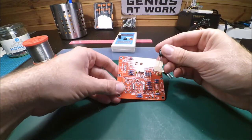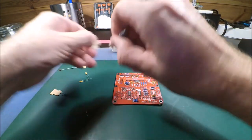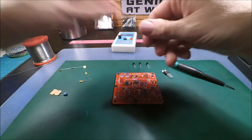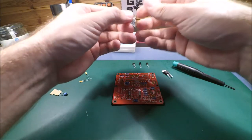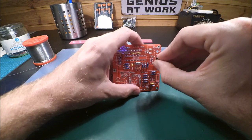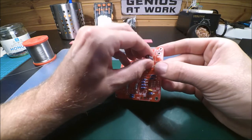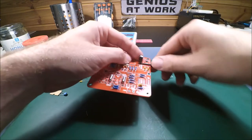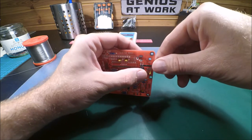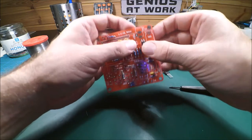We have the smoothing capacitor for the voltage regulator. This is an electrolytic capacitor, so you have to check the minus polarity against the PCB marking. To have room for the LCD display, you pull it up a bit and then use a screwdriver to bend it so it stays down close to the PCB. When you solder it, check that it sits flat and nice.